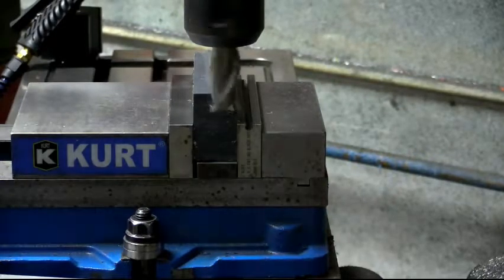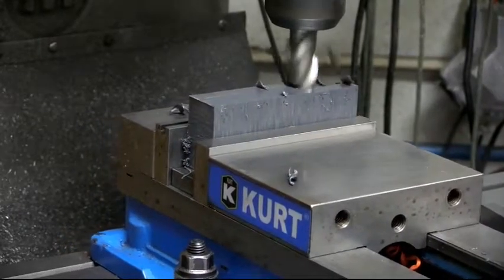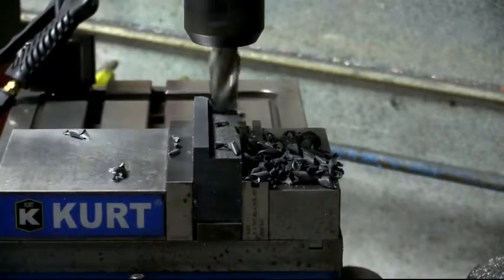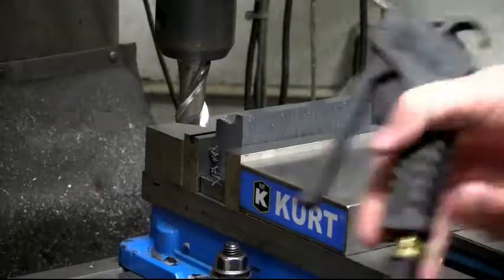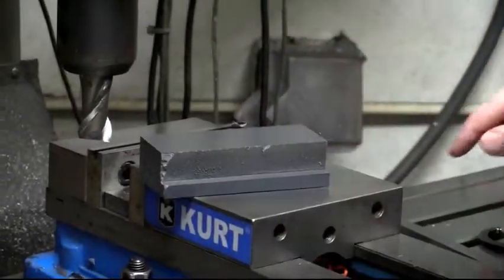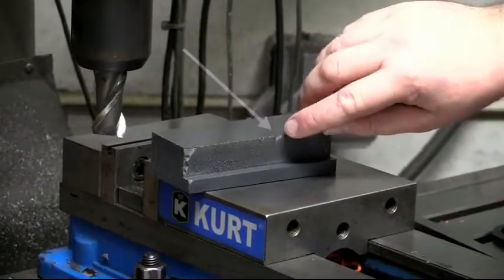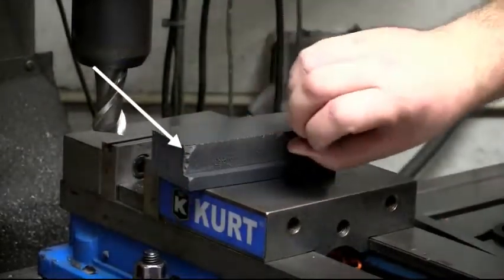I'm going to try to illustrate that here with this piece of PVC. You can see here where the cutter was sweeping this way and pushing the material out into space past this wall. It's not supported at that point, so you get this fracturing happening along here. There's a nice big chunk, a bunch of chips. And at the end here, this piece was unsupported and it just literally pushed that right off.